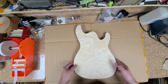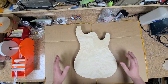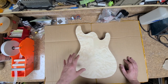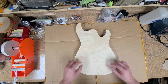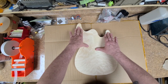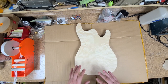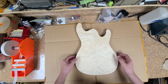The next step is applying a veneer to the top and getting it to suck on there without splitting. I'll be using veneer tape in some areas — a strip across the bottom, across the top, maybe one across the middle. This area I don't think I need to worry about much since there aren't too many bends, but I don't want it to split during the cold pressing of the veneer.